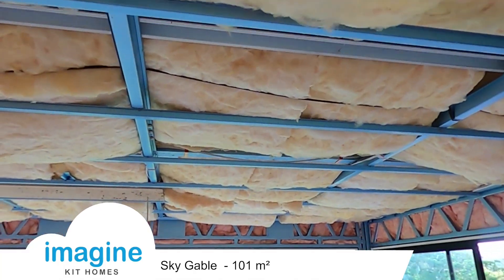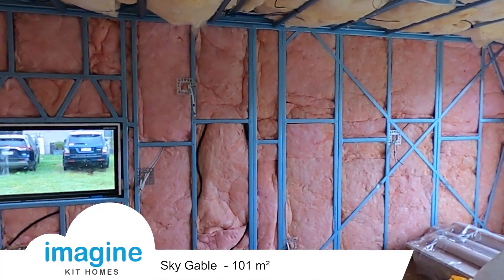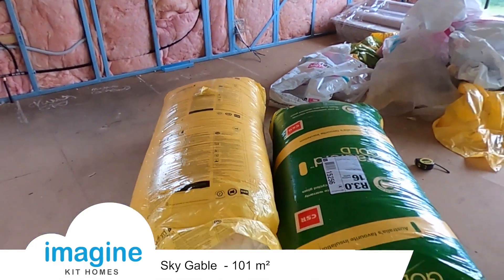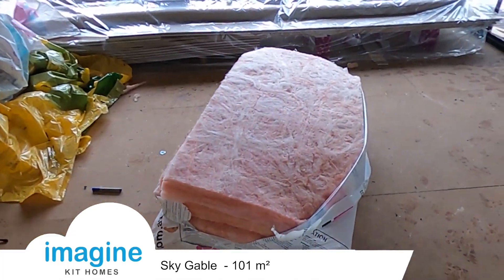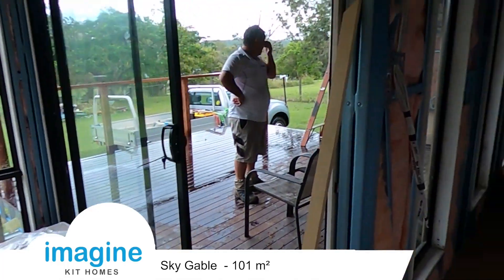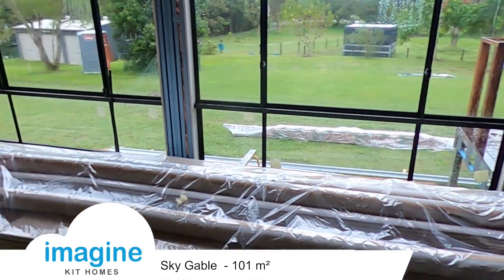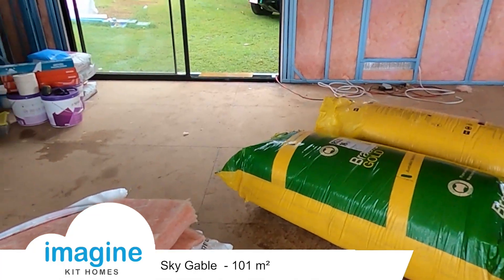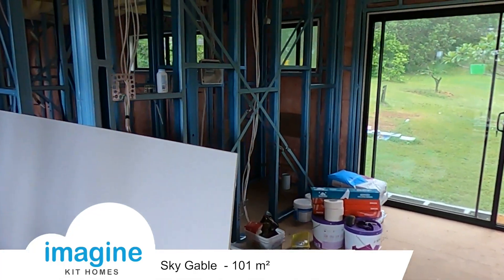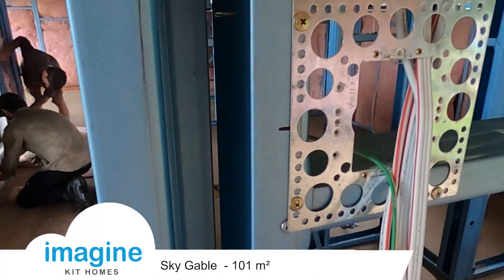Putting these in — you're itching for a month of Sundays afterwards — but it's very effective. It's a nice lightweight bulk insulation. We've got R2.5 in the ceiling and I think it's an R2 on the walls. So the electricals are done.